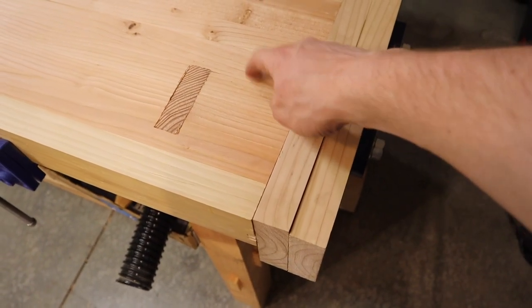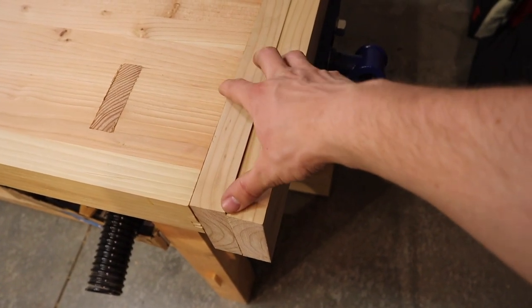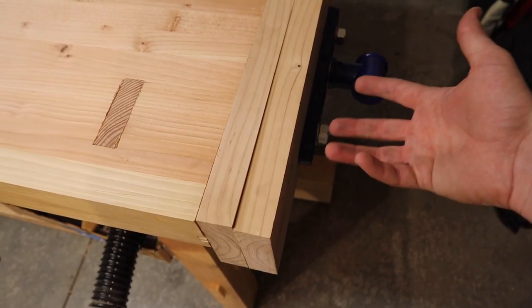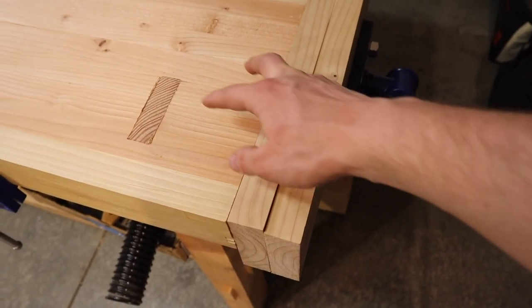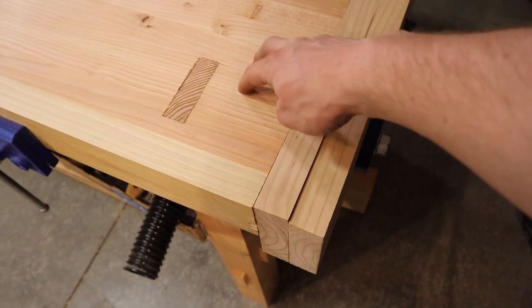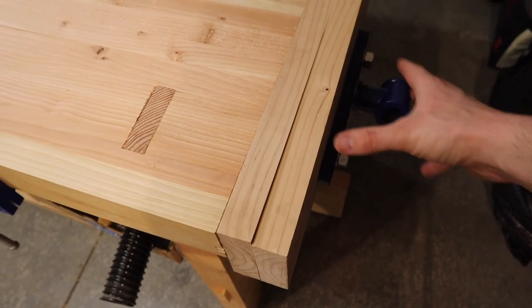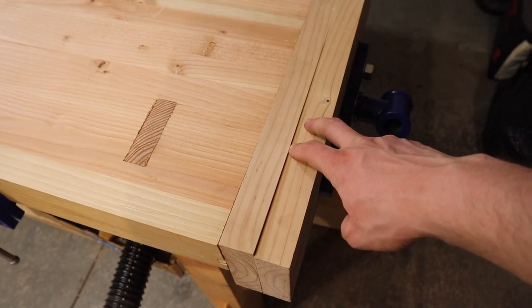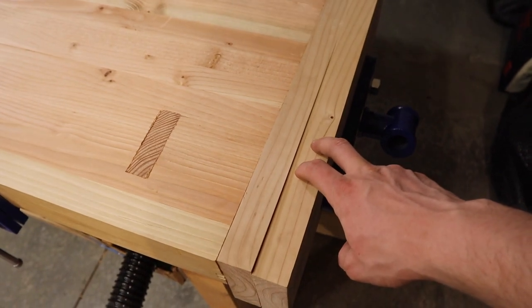Here's kind of what I ran into. So I did start by mounting the underside that's underneath right over here, but then once I drilled all the holes out, which, when you're drilling the holes out, I actually had one size too large on the screw, and I think that turned out just fine because most of these are just through holes that you need to have. It's when you have everything else in here, the mechanical components, whether it's the major mount that comes here, the two pieces that mounted to this guy, or this outside piece, those are what are going to be keeping everything in line. And so I wouldn't worry too much about the actual exact positioning on these holes. Just make sure it's close enough that it doesn't bind up.